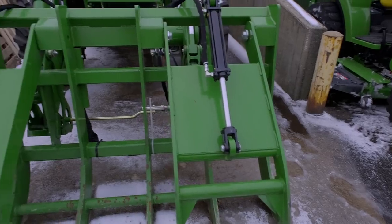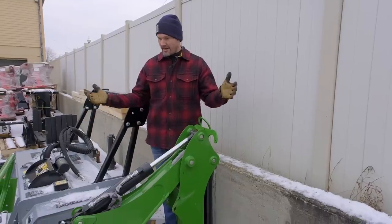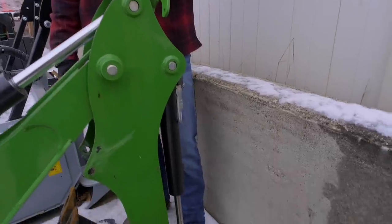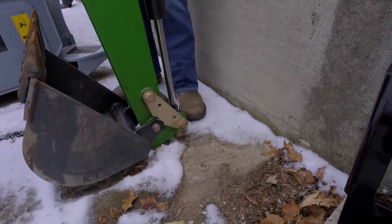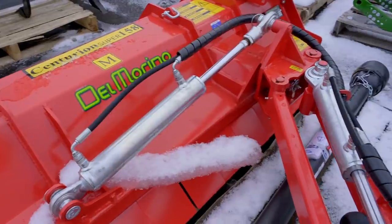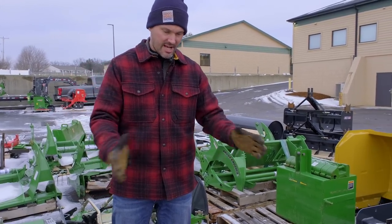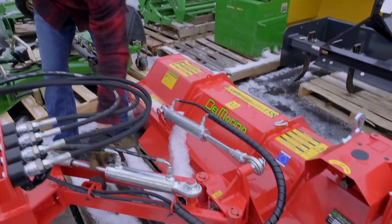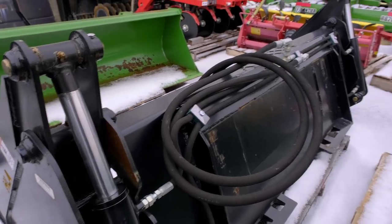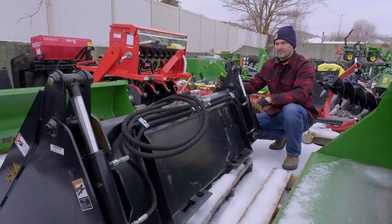Take a look at a grapple in the closed position — you'd think you want it in this position for storage, but doing so exposes the rod. Look at the backhoe here off my 1025 in the stored position: you have exposed cylinder rod here and another exposed cylinder rod down this way. On top of that, you've got the bucket curled down there collecting water and ice all winter long. Even brand new attachments come in just like this. You could rotate it so the cylinders were retracted, but you'd have a really awkward position for an attachment like this flail mower. Otherwise you're going to have exposed rods. On the four-in-one bucket you can see the exposed rods in what you'd think is the stored position — you'd have to open the bucket all the way up to have these retracted, which isn't really practical.